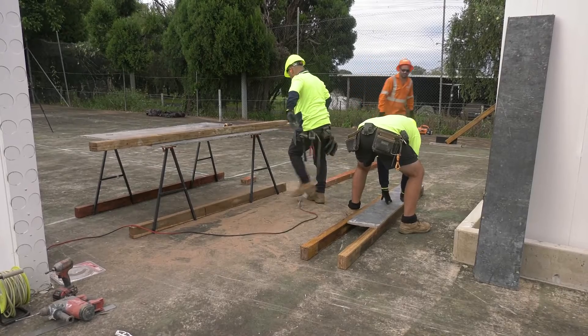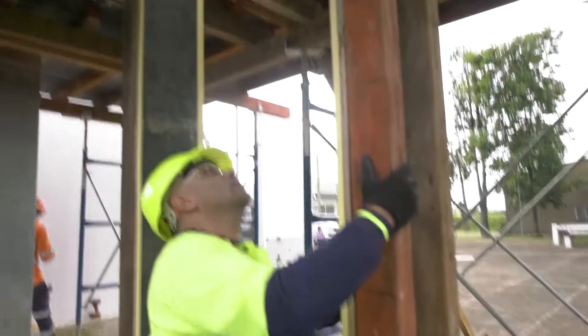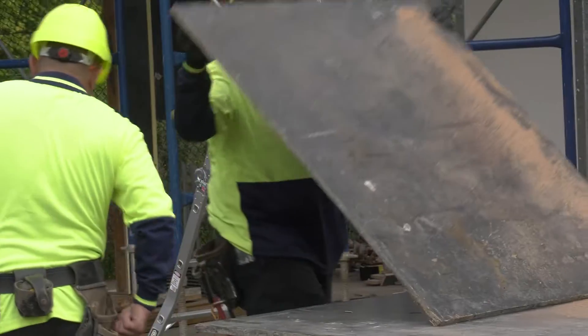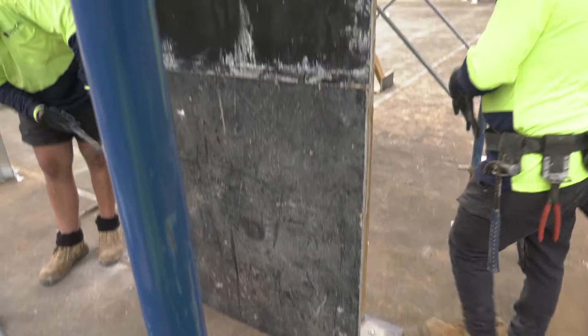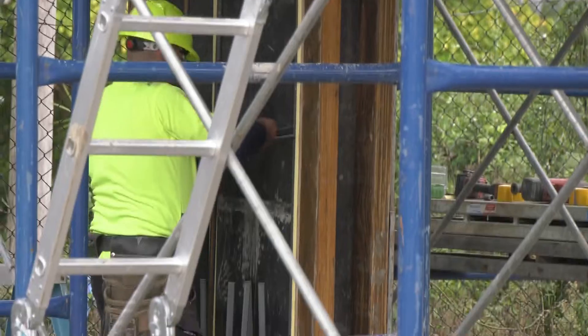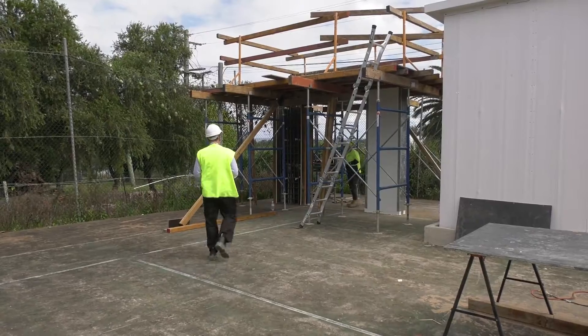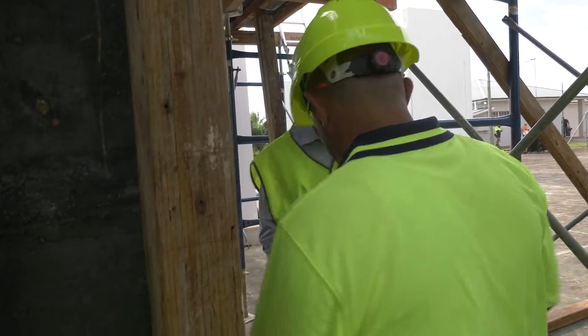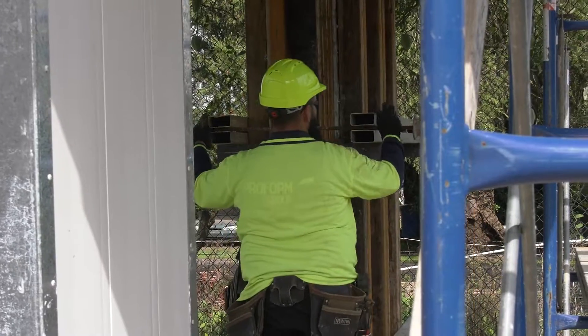Can you tell me how long it took to build a conventional column? From start to finish, it took me and another guy between three and a half to four hours. That's setting up our table, creating our stop ends, levelling them up to the deck, nailing on the back-end shutter, creating the shutter, placing the steel inside the formwork column, then getting it inspected and signed off, and then closing it off and tying it up using our strong backs and our Z-bars.